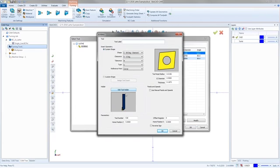So when we're adding this, you have to start thinking about kind of the holder that's going to go along with it. And depending on the hole that I have that I got to cut through, I got to make sure that holder is going to be able to even bore the center of this thing out. So when we get in here, we can start defining it. You know what? I'll leave this CNMG. I'm going to make my insert a 1/4 inch instead of a 1/2 inch, just a little bit smaller.